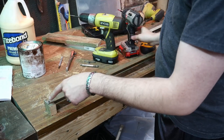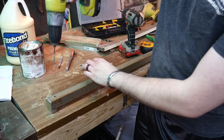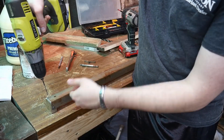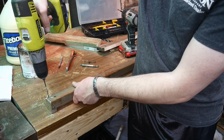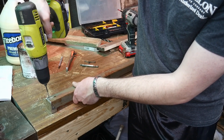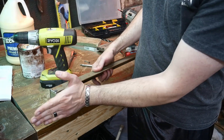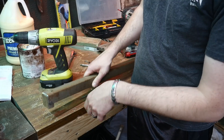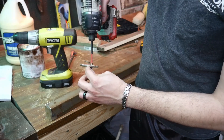I'll probably run into the screw coming from the other side. In the past I've drilled right through or come in at a slight angle. Just remember we're putting screws from this end too, so there'll be screws just barely missing each other. There's going to be a board pulling against the window frame, so having screws from multiple angles will help it handle that force being exerted on it.